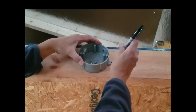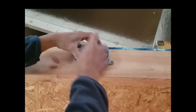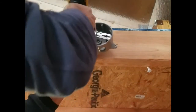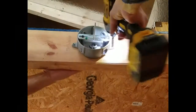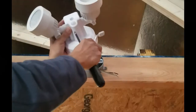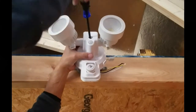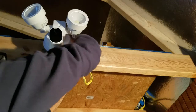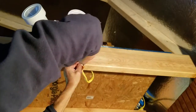I'll be installing my Wasserstein flood lamp inside of my man cave. I'm using the junction box as a template to mark the places where I'll be drilling pilot holes for the screws that I'll be using to permanently mount the junction box. Here's the junction box with the Wasserstein mounting bracket previously installed. Let's tighten it down, then put the Wasserstein sleeve nut into the lamp assembly and tighten it down. I am not using the included Wasserstein weatherproof gasket as it is not necessary for indoor usage. Finally, let's connect AC power to the lamp using the included Wasserstein wire nuts.